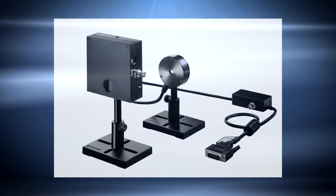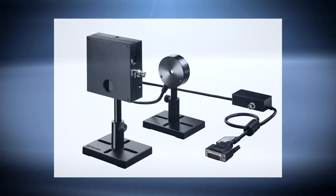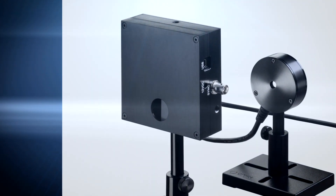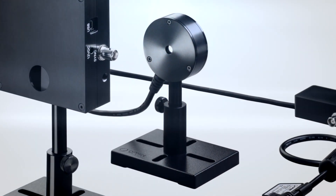It consists of a UV-enhanced photodiode-based sensor in conjunction with an 18 Hz chopper. The optical signal is passed through the chopper, and the 18 Hz chopped signal is then detected by the sensor. A digitally synthesized lock-in amplifier suppresses any signal not at this 18 Hz frequency, so external noise is kept to a minimum, and the sensor measures these 18 Hz pulses only.